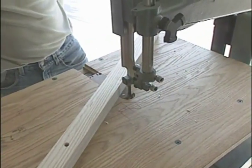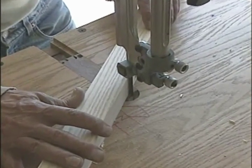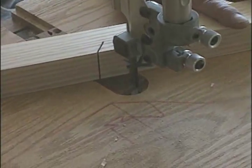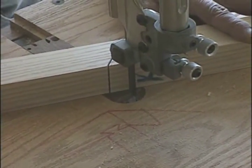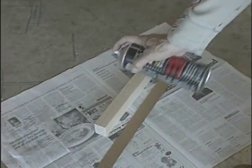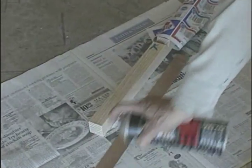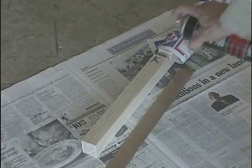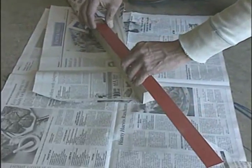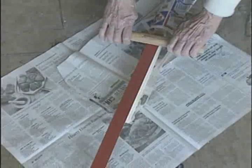Or you can make that pivoted straight stick fence function like a jointer fence on a router table. Dimension it fat enough to resist bending and saw out a V-notch to contain your straight bit. The height difference between the infeed and outfeed sides of the fence you can accomplish with a layer of Formica, which is about 60 thousandths thick. A better choice would be a thin sheet of aluminum, say 15 to 25 thousandths, because the cut will be lighter and less destructive.